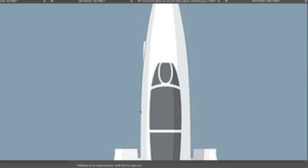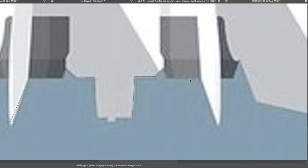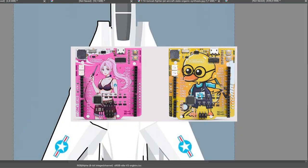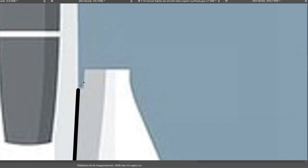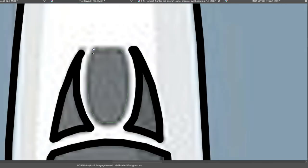I'm not good at drawing, so I had to grab an existing image. We need the outlines because I want to make the PCB look like a plane, not just a rectangle with a drawing. Full color printed PCBs exist, but the silkscreen usually supports only a single color, so we will have to draw the most iconic features: all the wings, the cockpit, and the markings on the wings.